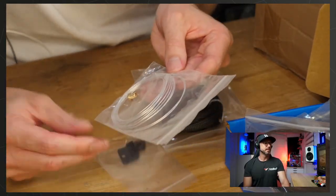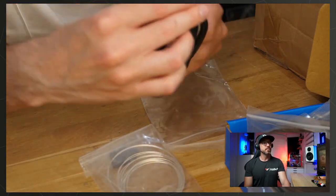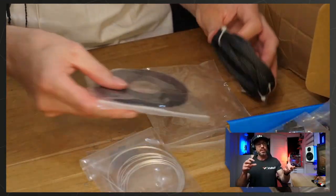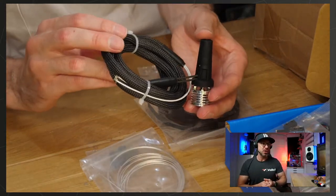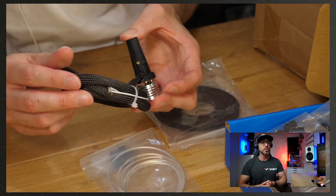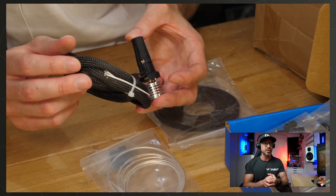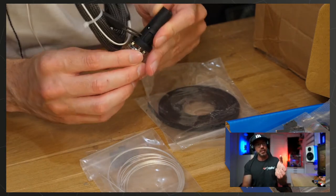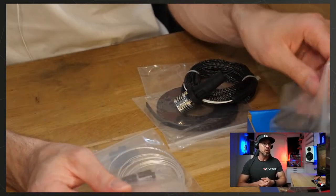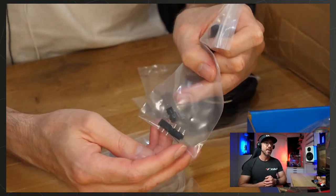We've got brackets, and this is a screw-in thermistor — that's your PT1000. It screws in halfway down. One thing about the silicone sock is you have to remove the PT1000 to insert the sock, but a lot of people just use scissors to cut a slit in the edge — it holds on just fine. That's probably something we could address on the manufacturing side. I personally rarely remove the hot end from my printer anymore — it's been there and never had any issues.